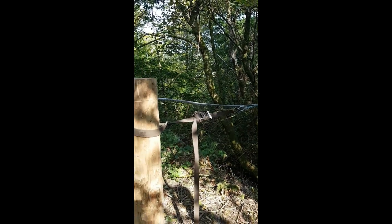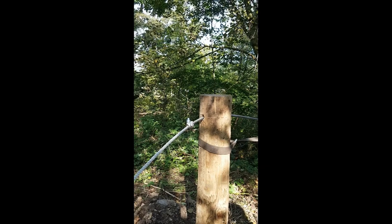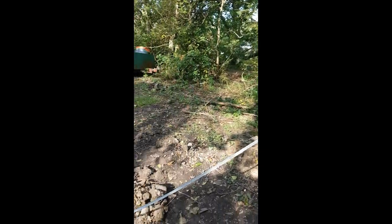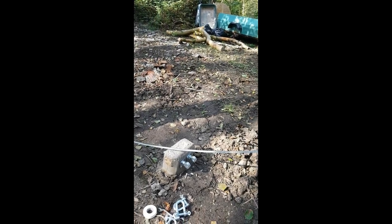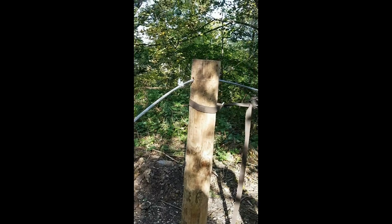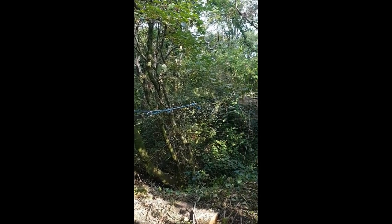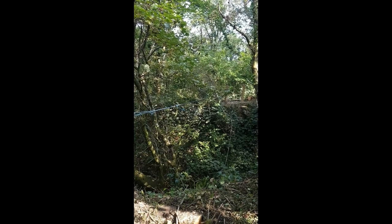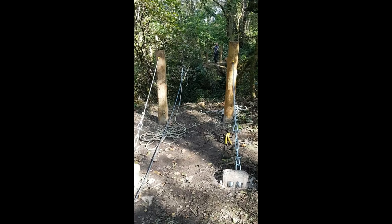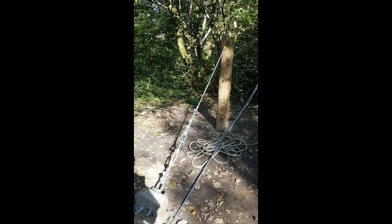We've got a ratchet strap acting as the tensioner, which gives us our free end. That clamp was there really to stop the wire from feeding itself back into the ravine. And that gives us the free end now that we can cut this, turn it over, clamp it into the bottle screw, and take that tensioner away. And that is one of them done. Seemingly much easier than we expected. That generally means that something might go wrong. The first two wires, the handrails, have gone in surprisingly easy, which is always ominous.